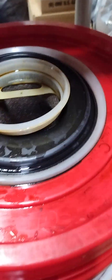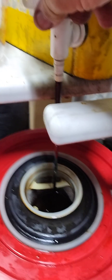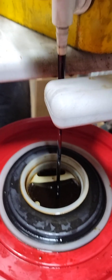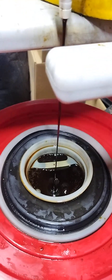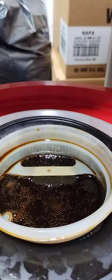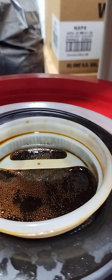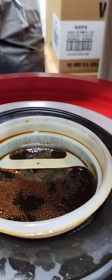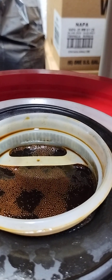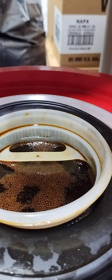This is our half micron filter. I'm going to add some oil — it's going to go right up to the top of the filter. The bucket's not full, but you can see how slowly the bubbles come up because air and oil are trading places. You can see how slowly this filters down. So again, stay on top of it — don't walk away from it.